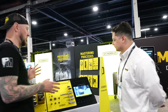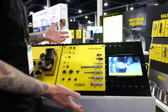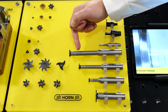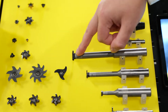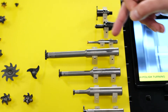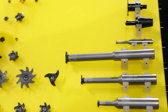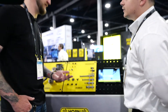Now one thing that always stood out to me with Horn is the grooving end of things — and this looks like grooving but for a mill. Here we have our mini milling system with our holders. This is a carbide holder with a steel head that has been brazed on. Our carbide insert fits onto this steel brazed head. The benefit is you've got a mostly carbide shank, which is very effective for vibration resistance. Another key point: if the seating surface on this brazed head starts to wear out, these holders can be repaired — sent back to us and we put a new head on, which is much cheaper than buying a whole new holder, giving you longer tool life and longer holder life.